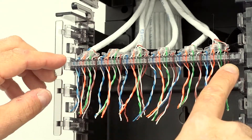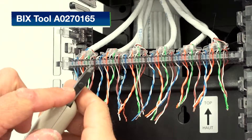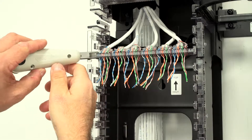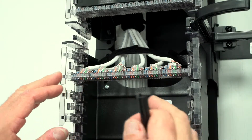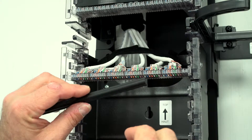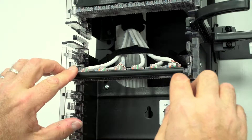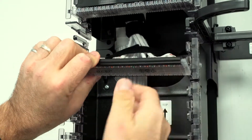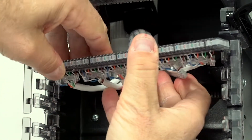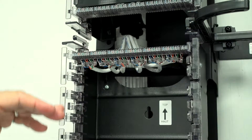We place all the cables, then we take the tool and make sure that the knife is on the bottom side to cut all the excess wire. Now that we have all the wires terminated and cut, we're ready to install the wire or the pair protector. We snap it over the connector — it protects and makes sure that all the wires will stay in place when we rotate the connector. This connector is going into the first position, so we flip it around and install it in the number one position. Then we're ready to start terminating the other ones.